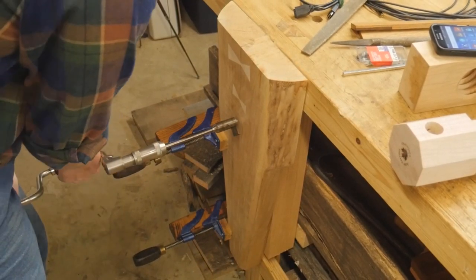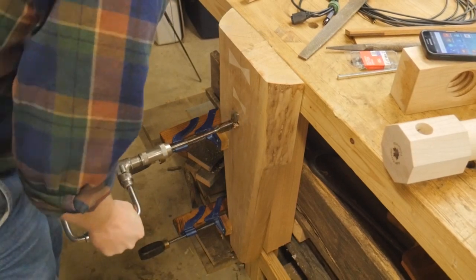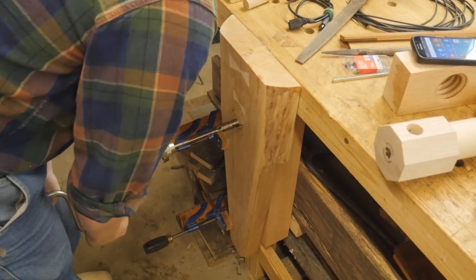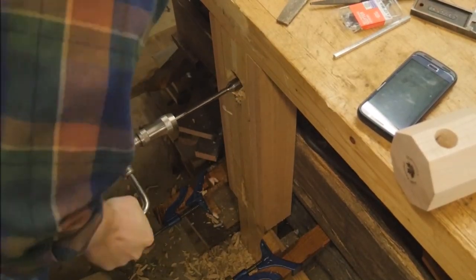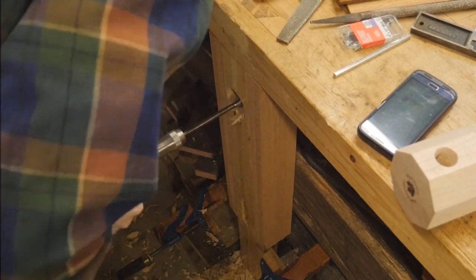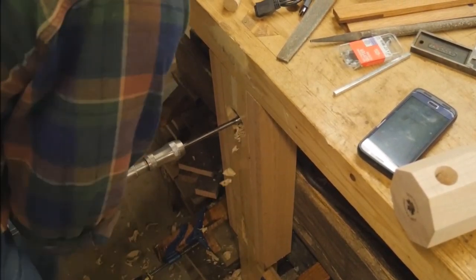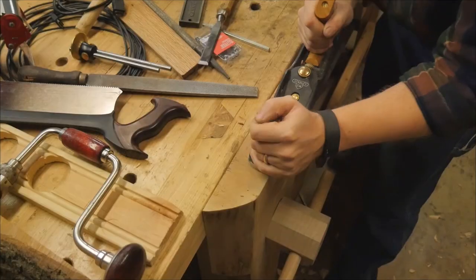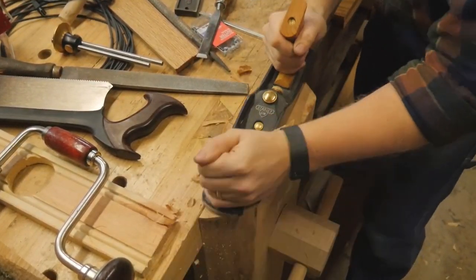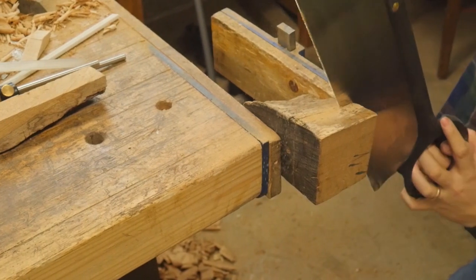Next I need to drill the hole for the main screw. I clamp the leg vise to the actual leg of the bench and then drill the hole. Somewhere around here I realized I didn't pick the right spot when I started drilling — I had to stop and move the hole down about three-quarters of an inch. I started the hole a little too large, so I have to cover that up a little later. But I drilled through the leg until the bit tipped into the actual leg of the bench, then put the vise aside and used the drill bit to drill the rest of the way through the main leg. With that in place, I can put the screw temporarily into the leg vise and then flatten out the top. This low-angle jack makes very quick work of that.